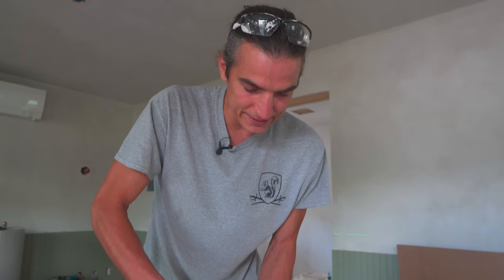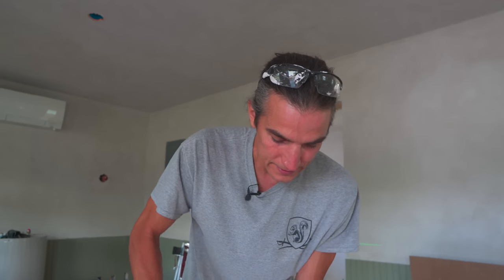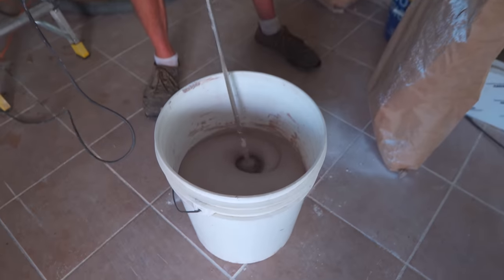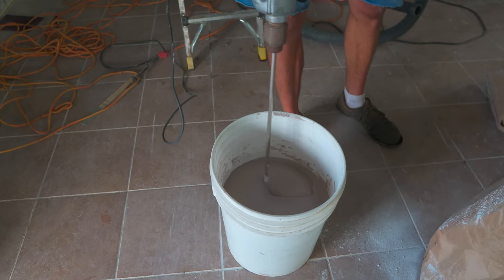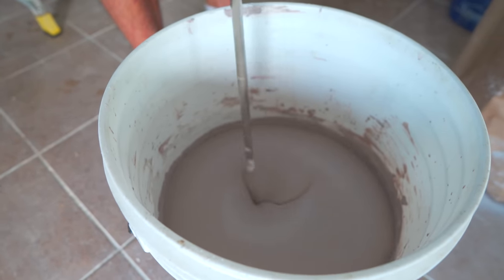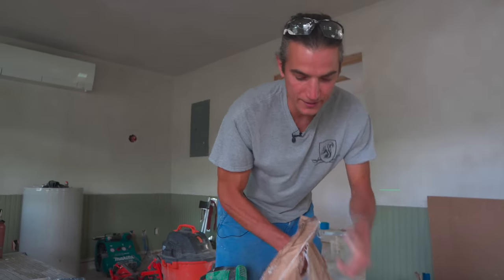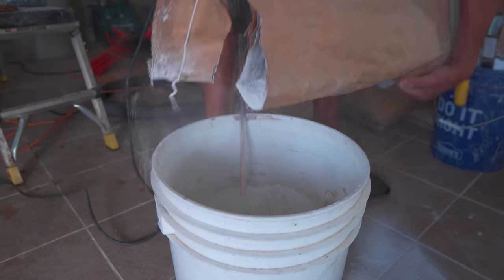But basically it's calcium carbonate. Depending if you're at a limestone quarry or getting it from coral or shells, it's just cool how calcium carbonate, when gone through a kiln, can turn into this really amazing building product. So you basically fire the limestone, depending on what kind of lime you're making. You see how creamy that is? Beautiful. You fire it at about 1500 degrees Fahrenheit and you can create your own building material that's super strong and can withstand the test of time.